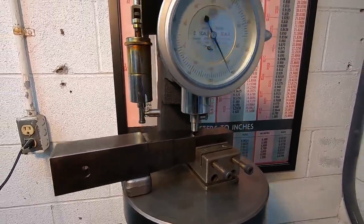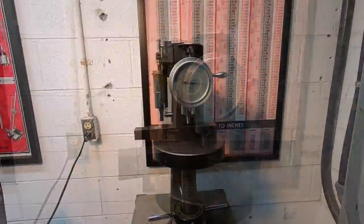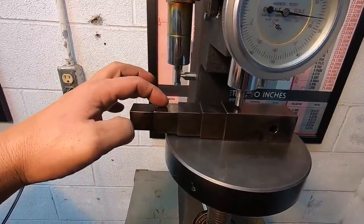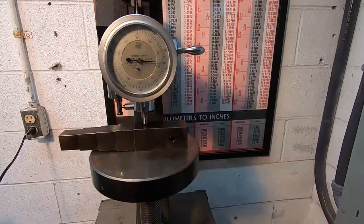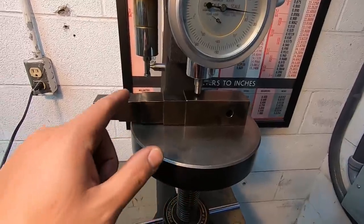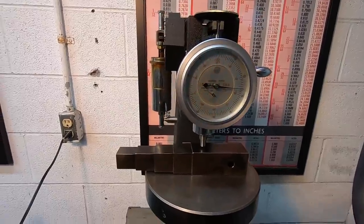So I am going to test it in three places total, and see if it's getting about the same reading there, and then I'll let you know. All right, so I've done a few tests along there, and in this area where I was testing it, there were two times where I got it in the mid 40s, and then I did it again and it was in the mid to upper 20s. So I'm averaging across there, I'm going to say 26, 27 Rockwell. So I'm not sure why I'm getting a higher reading there a couple of times. So maybe I'm screwing up and I'm not getting it set in the tester right. I feel pretty confident because of all the other spots that I tested that we're right there in that mid-20s range. So that's going to be it, I'm going to call it.